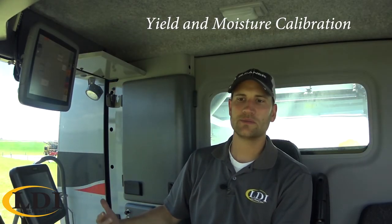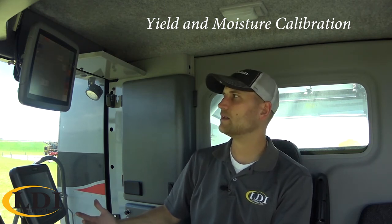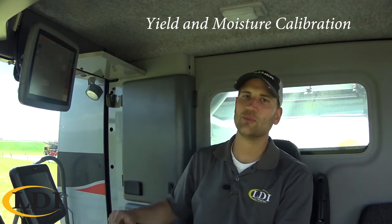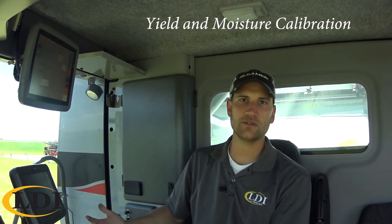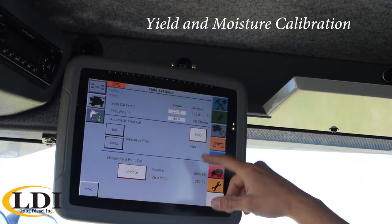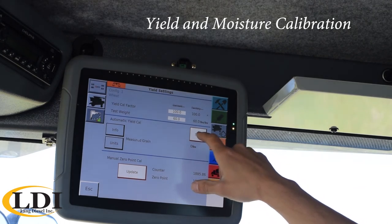We're going to harvest typically probably a full truck if you have just one machine in the field, so that you run that counter for that full truck. You haul that truck to the elevator, get the actual weight, and you can plug it back into the system. If you have a grain cart with scales you could do it one bin load at a time, but typically the longer you can do it the better. So let's say we dumped a few bins into a truck and we just got done filling that truck up — we'd come in here and hit stop.